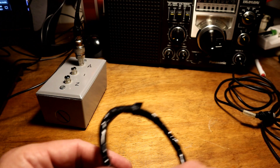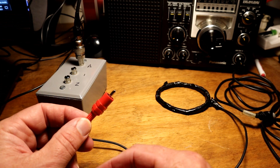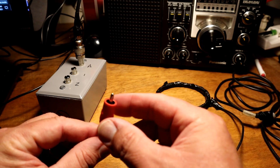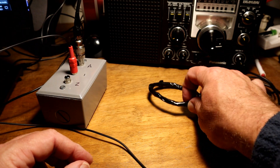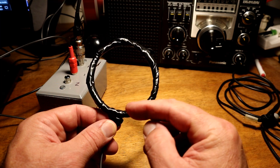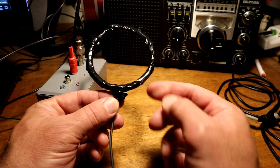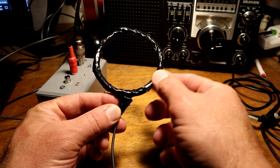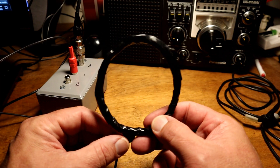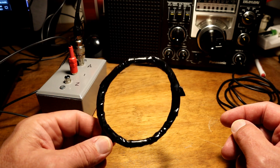Another feature — and I've showed this before in previous videos — is this little guy. This is for medium wave. I found an old RCA audio cable — just some junky old cable, nothing special about it. One end is the plug which goes into here, and the other end is about six or seven loops, about four inches of wire. One end of the wire is connected to the center conductor and the other end of the loop is to the braid — so basically the conductor and braid looped around seven times. What I do with this particular radio is I just loop it around and set it in the back of the radio. This is a nice coil method to inductively couple your radio for medium wave, and I use this all the time.